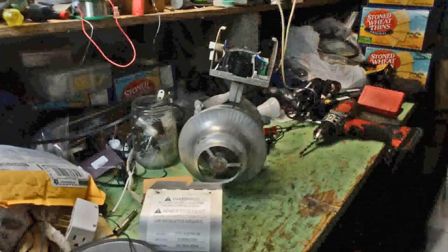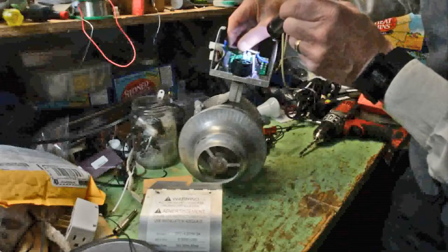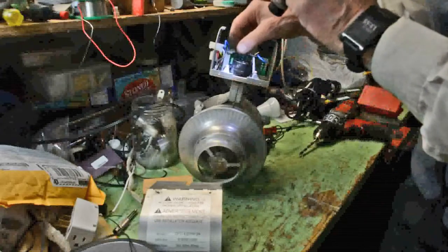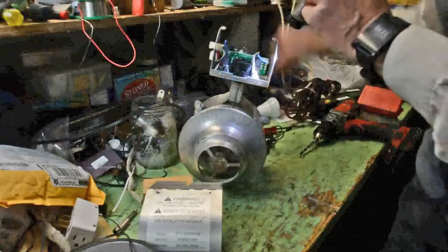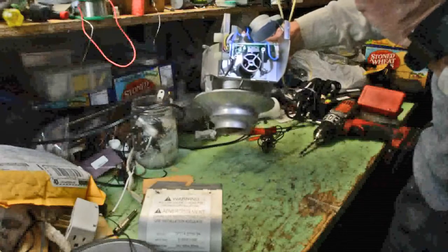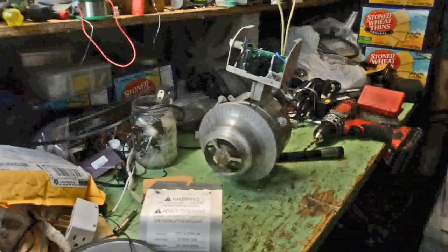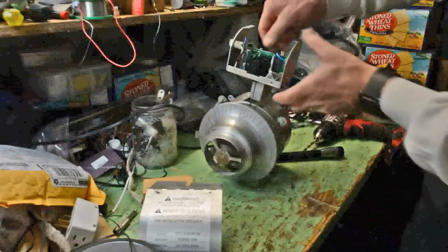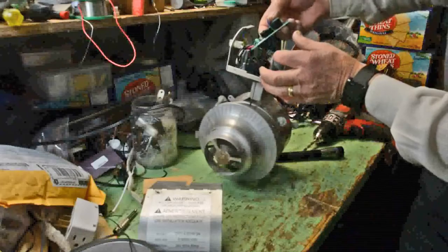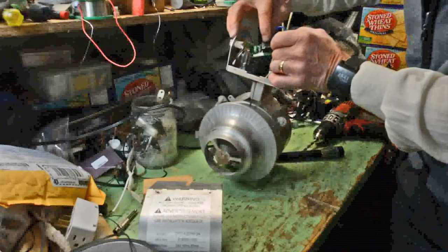Those 2 pins go through the mounting holes of the micro switch, and there you can see them. There's a mating pair that come up from the chassis on the other side of the micro switch row. Take that off, get it out of the way. There you can see more clearly the cam, the micro switches between the circuit board and the cam itself. And pull that circuit board off the pins that are on the chassis, and you can see the row of 3 micro switches. My thumb is on a relay. I didn't investigate what everything else does.